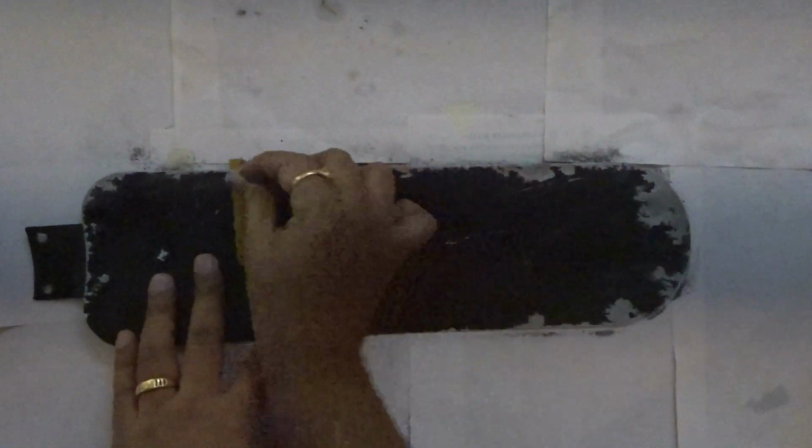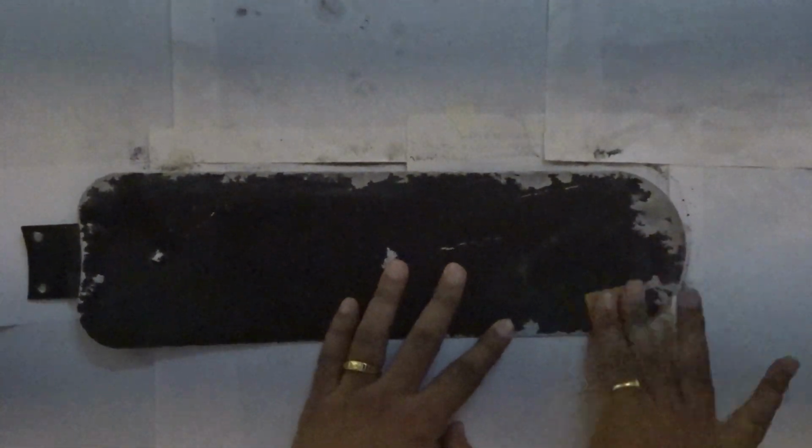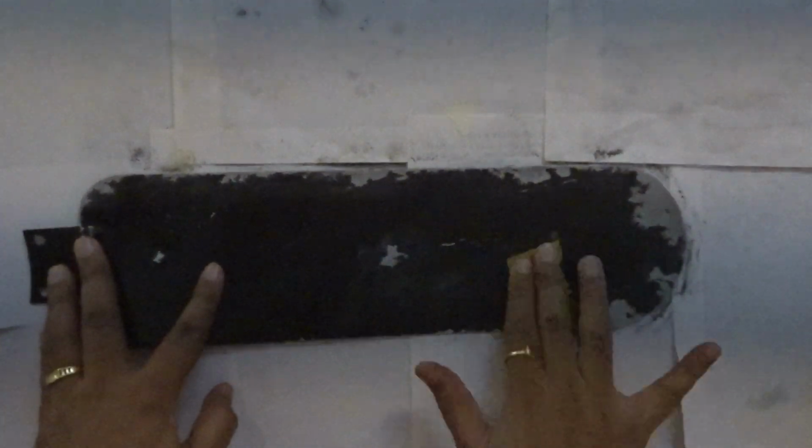After the metal is clean, it needs sanding. Sanding helps create a rough surface. Painted metal which isn't sanded will be more prone to peel or flake off. If you're prepping metal that's already painted, you need to sand it off and smooth it.